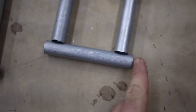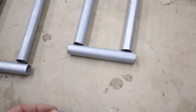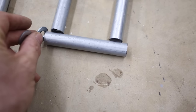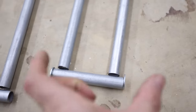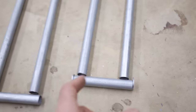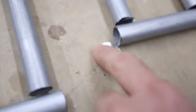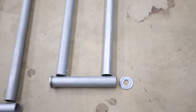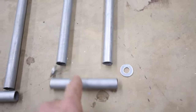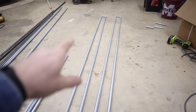On the hinge side, instead of using a skateboard bearing, we're just going to weld on a washer. The washer really just holds that through-bolt centered — the bolt that's going to hold the arm to the bracket. It doesn't need a full bearing; it just needs to be centered inside the pipe so it's not too loose fitting. I'm going to weld up the short hinge section with the washers first before attaching it to the parallel poles, then get the ends welded up.